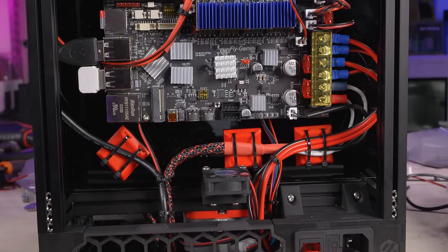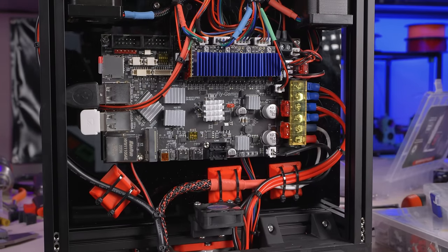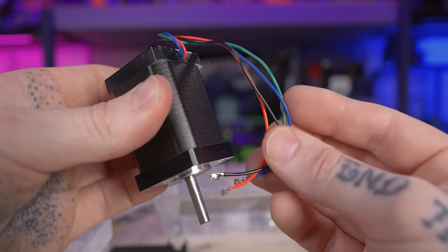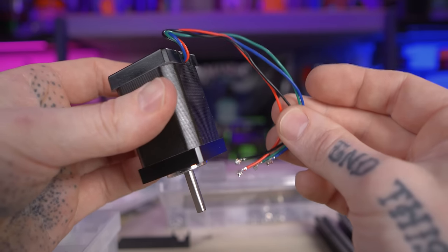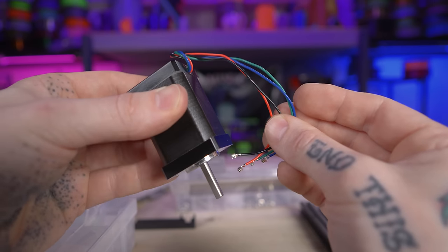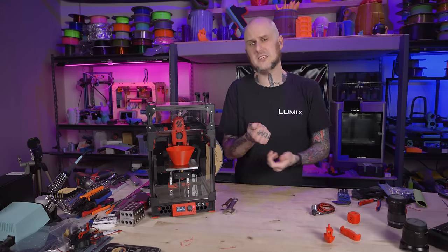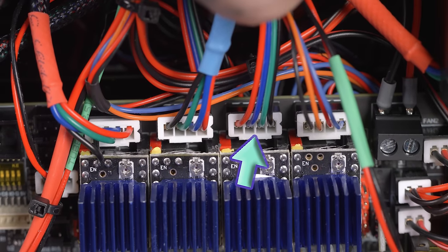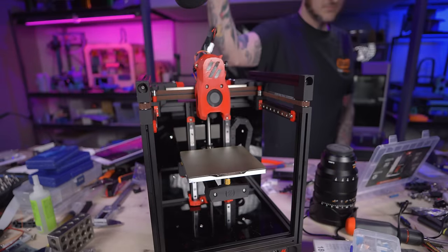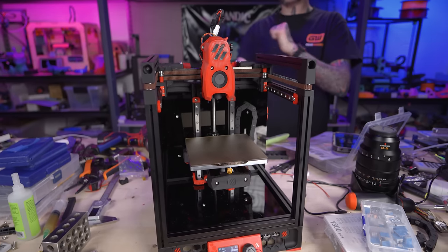Let's start off with the bad where we left off with the good — the wiring. Yes, there are various connectors pre-terminated and ready to go, but there are just as many that are not terminated or need to be modified to actually be functional. The A and B motors for the CoreXY system have terminals on the end of them but no connectors, so you have to pin those connectors yourself to the board using the diagram provided. But then some of the stuff that's already terminated needs to be changed — like the Z axis motor wire. When I plugged it into the main board, I noticed the middle two wires were opposite of the A and B motors. I thought maybe this is the way it's supposed to be, so I tried it — and I had to de-pin those middle two wires, flip-flop them, put them back in, and then I had a functional Z axis.